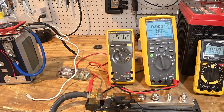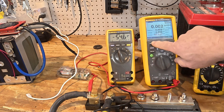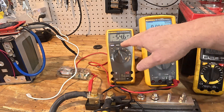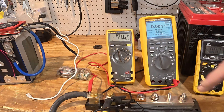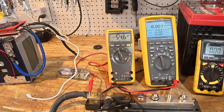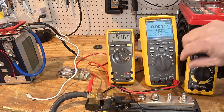510, 520 amps roughly — again, 390 on one reading, similar to what we got with the Fluke clamp meter. You can see how each time you do this it comes up a little bit different. That's why you want to do it a number of times and take your highest reading — that's the reading the battery will eventually see. This customer got away with it for a couple of weeks, but eventually it will catch up.